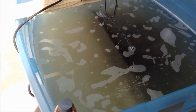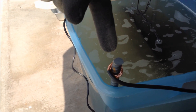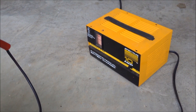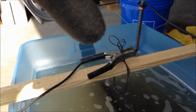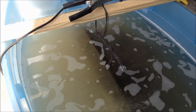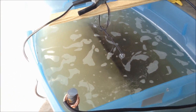What we're doing to remove this rust is we are negatively charging the cast iron and positively charging these electrodes. We use a regular 10-amp battery charger — hook up the negative to the item you want to de-rust, the positive to the electrodes. As you can see, there's a lot of bubbles. Those bubbles are hydrogen and oxygen gas. This can be flammable, so do not do this indoors — I've got a fan blowing these fumes outside.